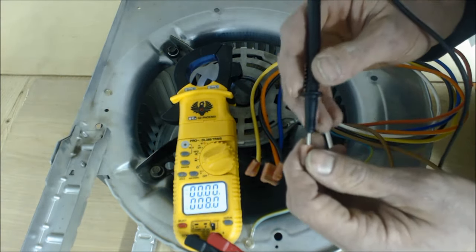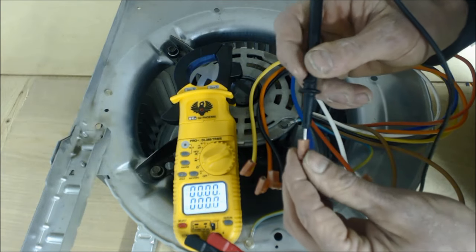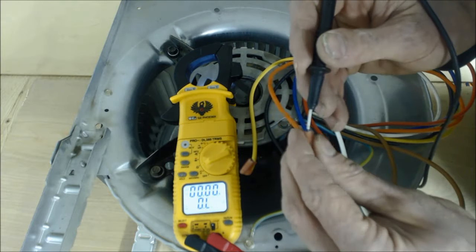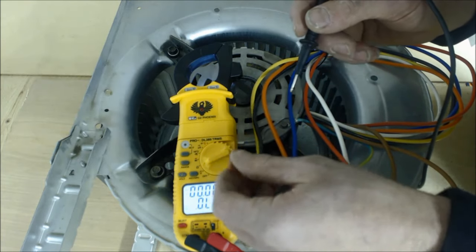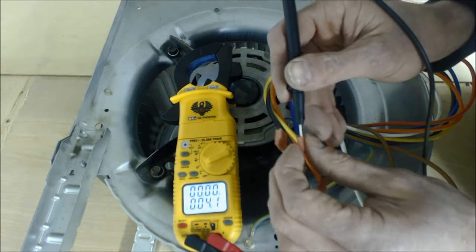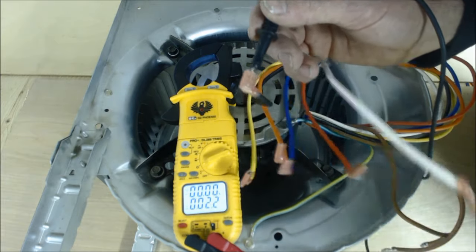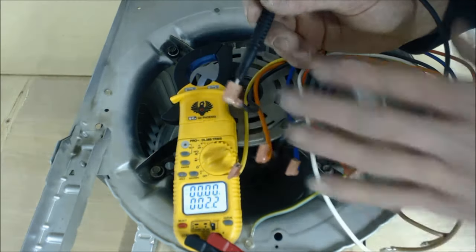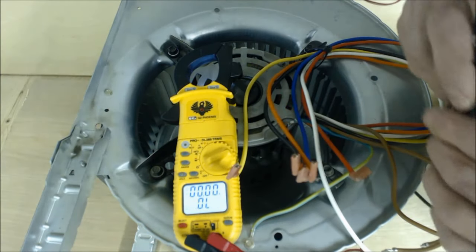Your highest resistance reading will be your lowest fan speed. This one is 8 ohms of resistance. The next lowest fan speed — second from lowest — is blue; in this case it's 5.8 ohms of resistance. Orange is your medium speed on this five-speed PSC blower motor at 5.5 ohms of resistance. Yellow is second from highest at 4.1 ohms of resistance. As we go up to higher fan speeds, the resistance gets less. Black, the highest fan speed, comes in at about 2.2–2.4 ohms of resistance.